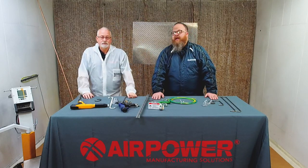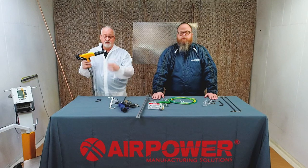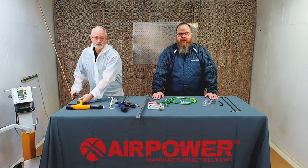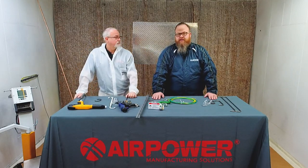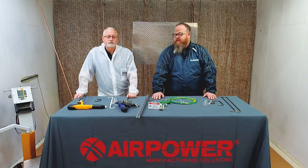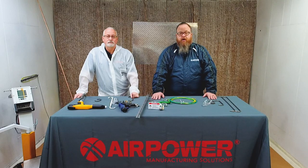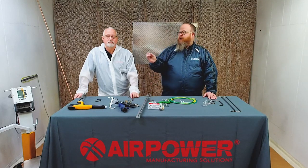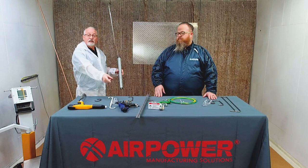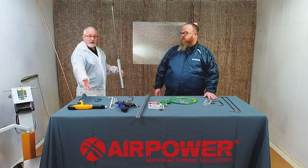All right, proper air caps and fluid nozzle. We touched on that a little bit. We did. There are a variety for both styles, powder and liquid. There's all kinds of nozzles. Don't be afraid to experiment with them. And don't be afraid to ask your supplier to show you different nozzles for your E-stat guns or your powder guns. There are different nozzles. There are different sizes for different volumes. And you know, a wider pattern can help with larger parts, or a smaller, thinner, or a round pattern for round parts, right? You can do a round pattern out of a liquid electrostatic gun. You can do it out of a powder gun. Match the profile of your part with what you're doing out of your gun.